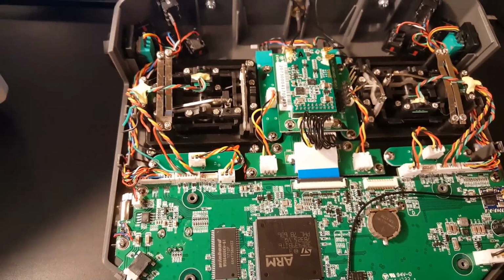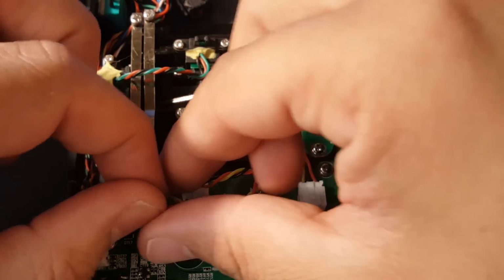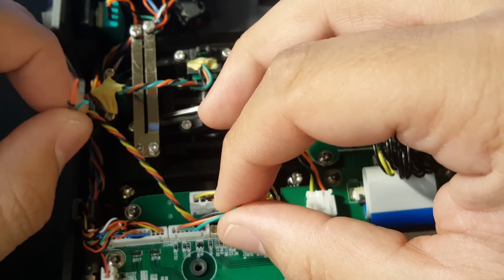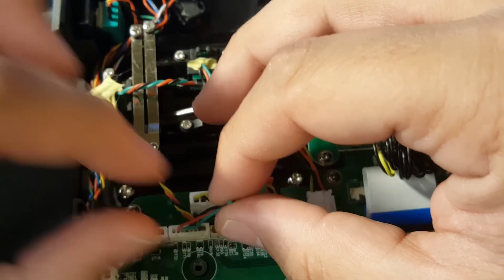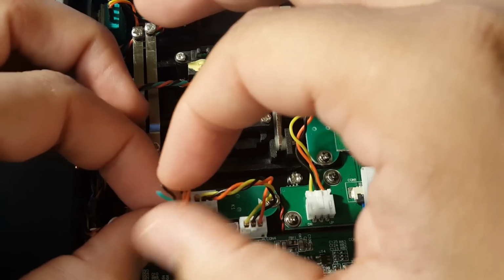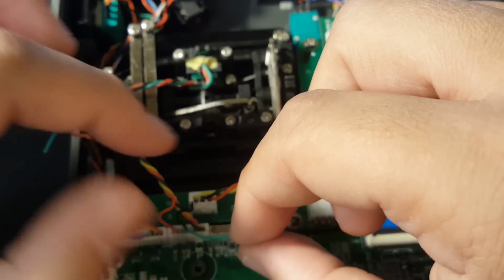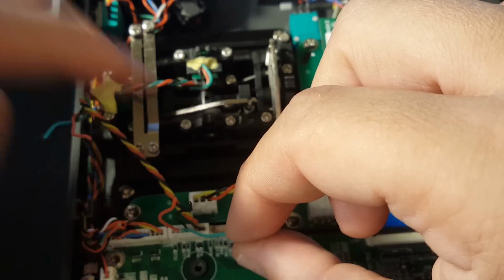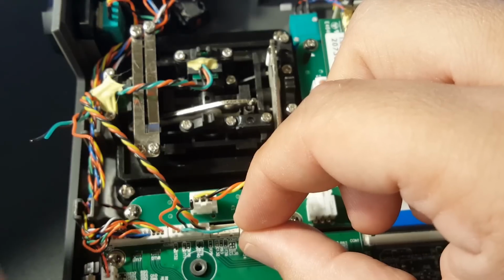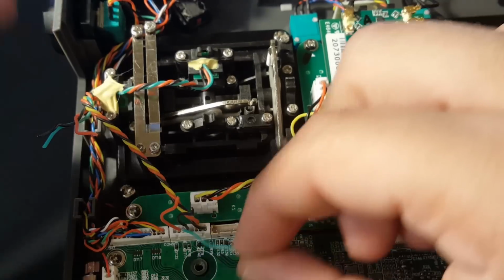Since I cut those two wires, it's kind of difficult to make out right now, but you'll see them. So here we go. These are what's coming from the roll axis, so channel 1. And these are coming from the board. The green one here is actually reading the input from these wires, and these are just power to the gimbal. It takes the power, and then it makes the green one, which makes resistance, and then it returns back high voltage or low voltage, thus telling you exactly where the location of the throttle or the gimbal is, or whatever the position is.